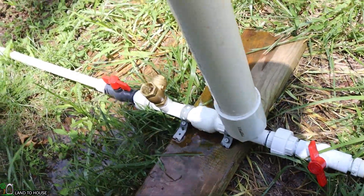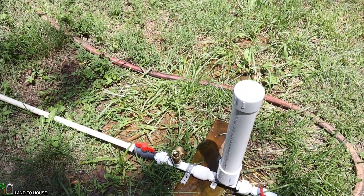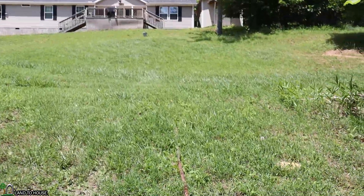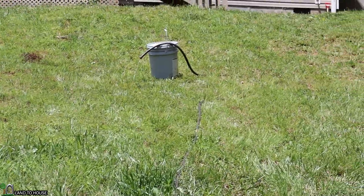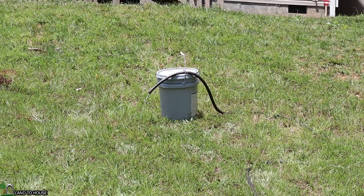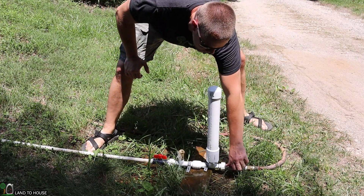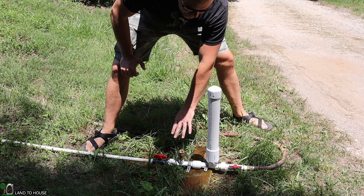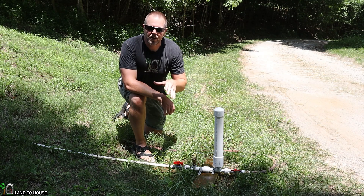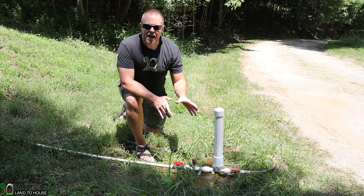Let's try again to get it to keep going. It's real tricky because now the valve is more closed than open, but I am still seeing water coming out up here. There you go — you can see the water coming out now on the spot where we had the bucket a little bit lower. Now just to prove the point, let me open the delivery valve all the way up again, and it should stop the pump. Too much head pressure, not enough back pressure on the pressure tank. In my specific setup here, it's a bit difficult to show how sometimes the pump can run for 10 minutes, an hour, or even half a day before it loses back pressure.